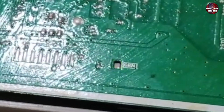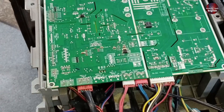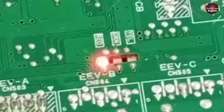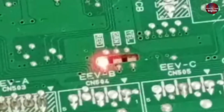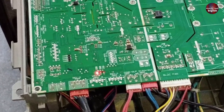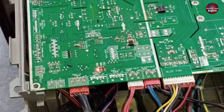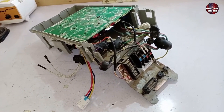However, if the error still appears, I'll show you the other lights on the unit. When we come to the other side of the unit and you turn on the power, you'll see that the red light on the PCB turns on continuously. If it stays on, it indicates that the error is indeed the E101 error. This way, you can easily identify the error on the outdoor PCB.